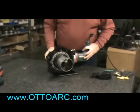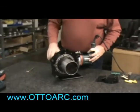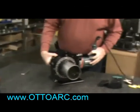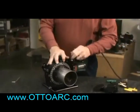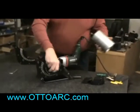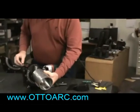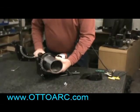Today we are going to set up to do a piece of 4 inch tubing, and how the machine works is you have your head that fits down, your collet, which gets put on. The machine, you'll notice, has floating heads, which makes it so it's easier for your tubing or pipe, if it is slightly out of round, to be able to put it back in.